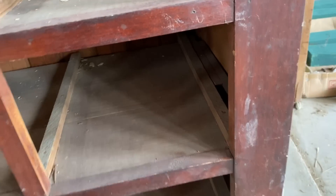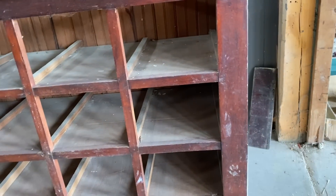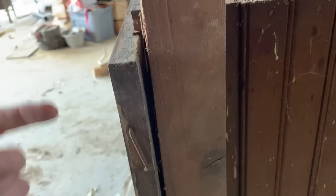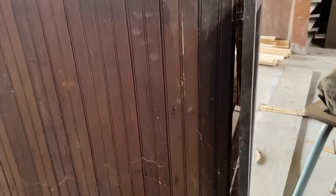This end board is just basically finish nailed into these shelves, and clearly it's pulled out once over the years so that's not quite enough. I drove the original finish nails back in but I think it needs just a little bit more — something solid to anchor to. So I have this piece of wood and I'm going to cut it to length and stick it right in the corner. Then I can use regular screws because they won't be visible, and mount that all along the back. I'll have something solid to put those finish nails into so it won't come back out again. Then I'm going to do the exact same thing on the other side.